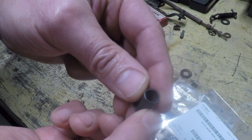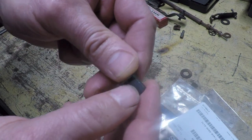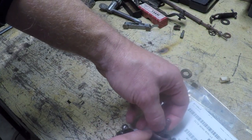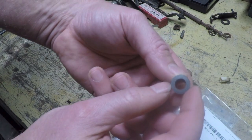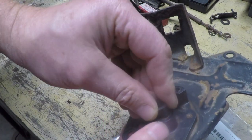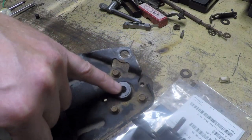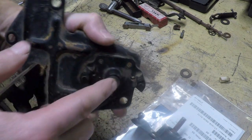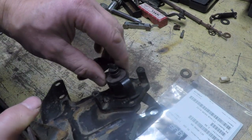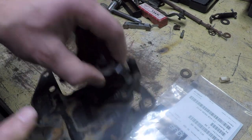That's a perfect fit on there because it's 5/16 — it's a little loose, but that's because it's going to squeeze down once we press these 3/8 sleeves in here. These are going to be pressed in. I just used my arbor press, and quite frankly these went in fairly easily. The arbor press just ensures that they go in nice and straight. That's going to be a big improvement over how stuck that was before.